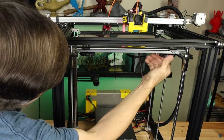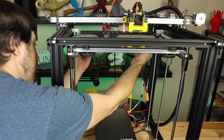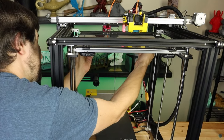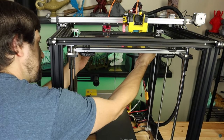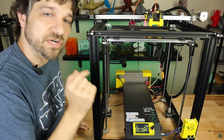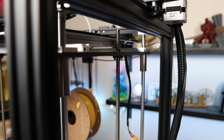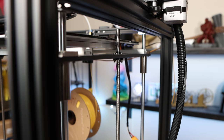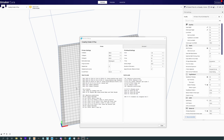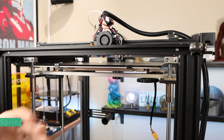You may be asking about the Z-stepper auto align using G34. Sure, you could use that — in my G34 video I describe how to do that by cranking down the springs and using G34 to level the bed left and right. What I found is that this isn't necessary; by doing the ruler method first you can then use G34 just to correct it. These days I've added G34 to my startup G-code so it runs at the start of every print, not for this initial alignment.